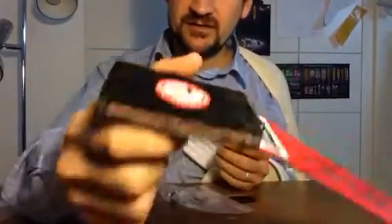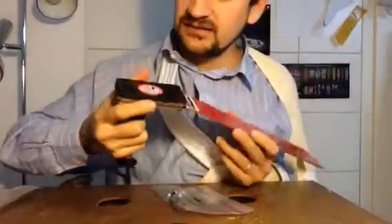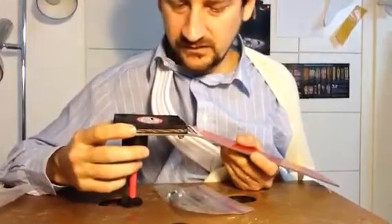Presumably right at the very end, when you get down to the material or even deeper, you'll actually start hitting the screws. At that time, it's a good time to change the pad, because otherwise you won't be able to get the screws out anymore — they'll wear away.